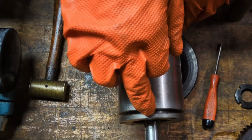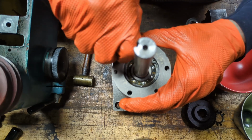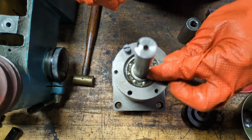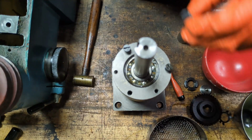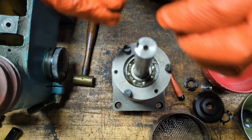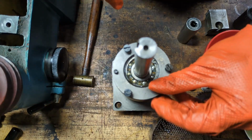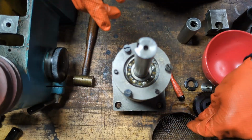So I'm going to install the set screws and also the hold down screws and think about it from there. 6 holes here, 3 of them are threaded and 3 are not, and obviously the screws that are meant to hold things together with this flathead top go through this cap here and screw into the column, and the set screws simply thread into this piece here, and then again act as a stopper to hold this up above the column.